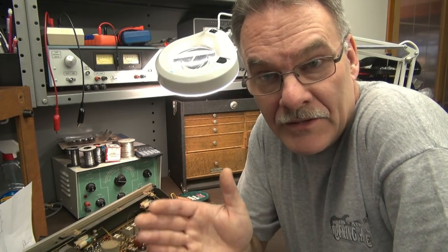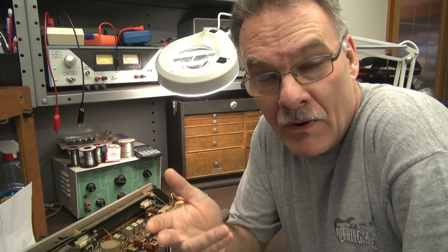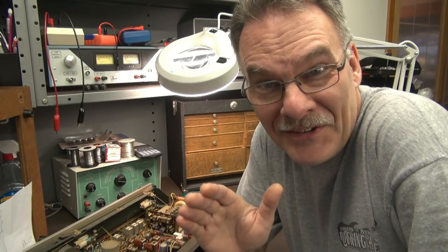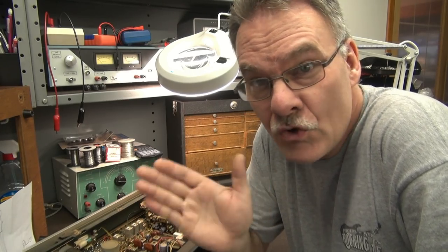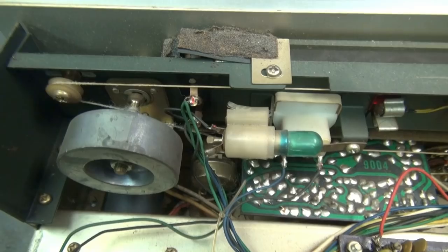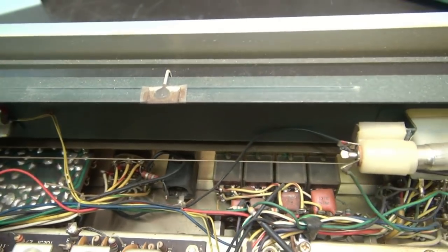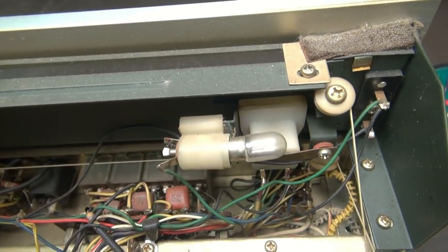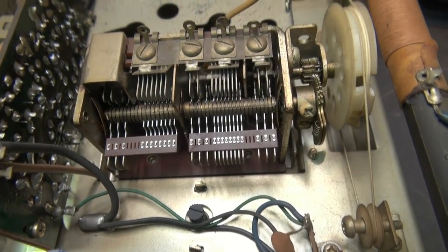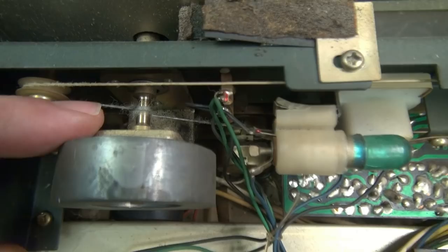Normally this is not a task I would do in the shop, simply because of the value of the unit and its age. However, I did get some assistance from Solid State Sissy, and she talked me into it. But the real reason is the guy's local, he's cool, and he really loves this old receiver. So here's the dial cord routing in the realistic receiver — she takes off across here, grabs hold of the tuning needle, another pulley does a right turn to the tuning cap, and there's a little idler pulley behind it. The problem is right behind the flywheel — if you look down there, you can see a lot of fraying.